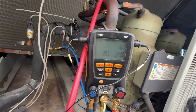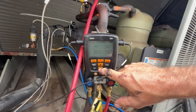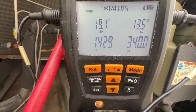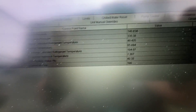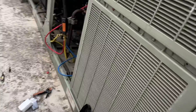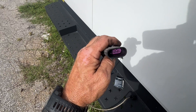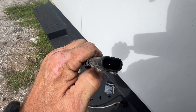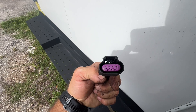All right, it just fired back up. You can kind of see some green corrosion going on inside that cable — so that could be our intermittent problem. This end looks pretty clean though.